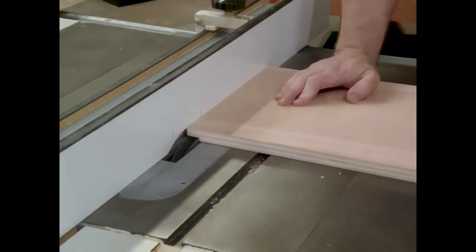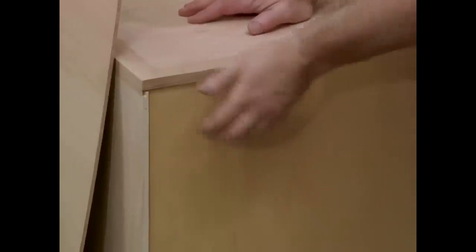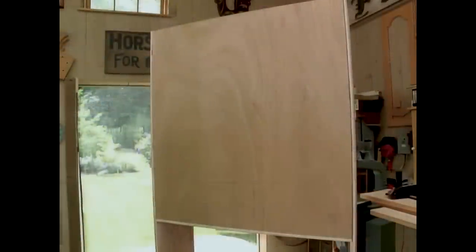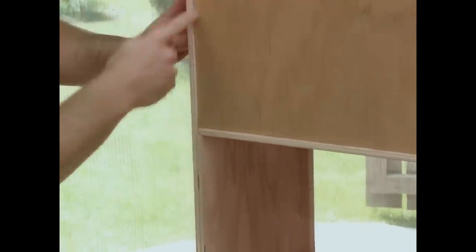While I still have the stacked dado head cutter set up in the table saw, I want to make a rabbet in the bookcase sides to receive the fixed top. The next thing I want to do is make a rabbet along the side panel to receive the quarter-inch plywood backs. The door case will get a piece of oak plywood for its back. The drawer case will get Luan because you'll never see it. And of course, the bookcase will get another piece of quarter-inch oak. I've turned around the bookcase unit so I can show you what's happening on the rabbets at the back. The lower fixed shelf has a rabbet for the plywood to sit in so it won't show through at the bottom edge. The rabbets along the side pieces are actually stopped rabbets — they end right here so that this won't show on the inside.